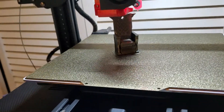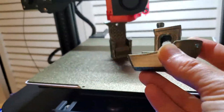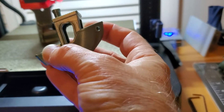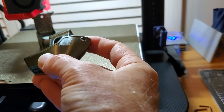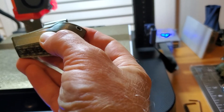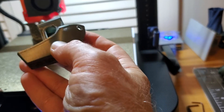To close this out, let me show you some of the stuff I printed right off the beginning without any calibration at all. I printed a Benchy and it actually came out really nicely. There are a couple of things that aren't perfect — there was some kind of a shift on a layer, right where my fingernail is. That's probably a Z-axis issue or it got bumped. Other than that, it was perfect though.